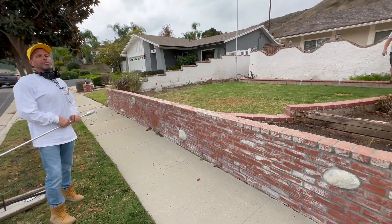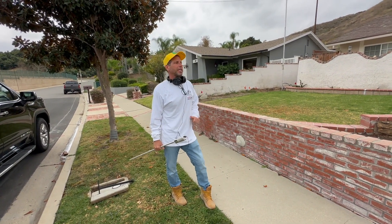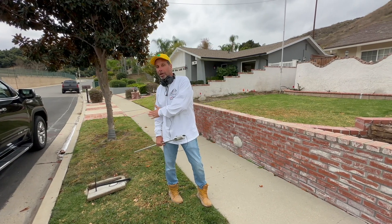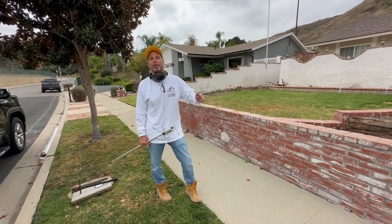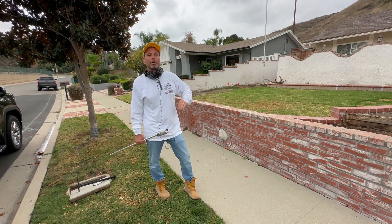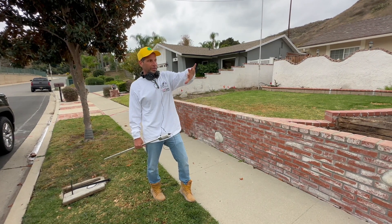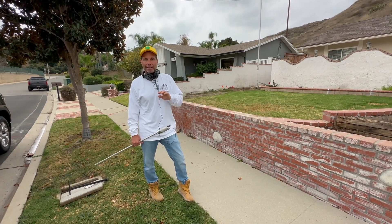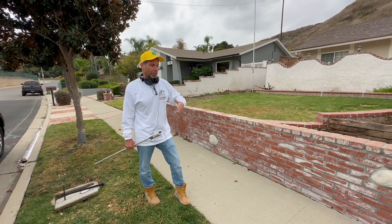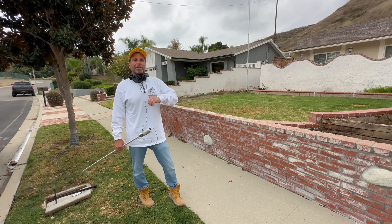We listened to all the sprinkler valves. If you can isolate sprinkler valves, a swimming pool autofill, or other components, you can come back to the meter and it will tell you whether what you shut off is actually leaking. We need to turn everything back on because when we listen, we need it to actually be leaking. We ruled out all the irrigation by listening to those valves — when those valves leak, and they do very often, they're really loud and they'll tell you whether water is releasing to a low point or a green grassy area.